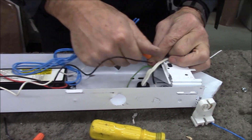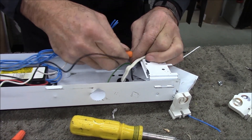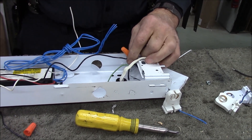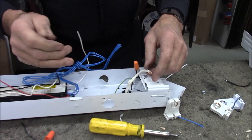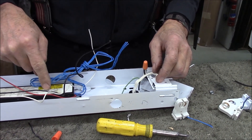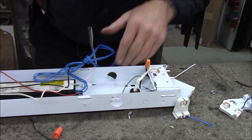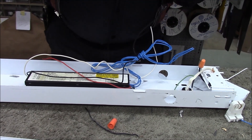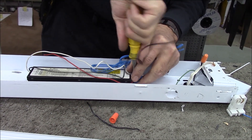There are some LED bulbs made to be ballast-driven — for situations like a commercial plant where nobody is available to rewire the fixture. However, when you buy an LED bulb that still uses a ballast, you're still wasting electricity. So what we want to do is take this ballast and get it out of here, so we'll have 110 volts going directly to our LED bulb.